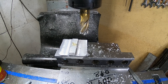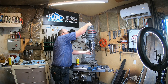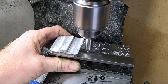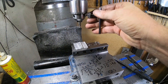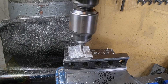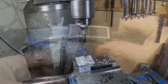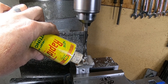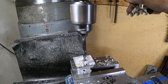For the moment of truth, let's take a quick measurement, zero our calipers, and stick it in there to see how much clearance we actually have. Six thou clearance is probably really good — tight enough that it's not going to flop around, but loose enough that it's not going to get stuck. Now it's just a matter of taking advantage of that parallel in there and drilling the hole for where that bolt's actually going to go. I found the edge on the parallel, came over 100 thou, went back to the center, center drilled carefully to avoid drilling into the parallel, then grabbed the drill for the threads — basically measuring the outside of the bolt threads and adding about five thou for clearance. If you have a shoulder on the bolt, measure the shoulder and add five or ten thou clearance.